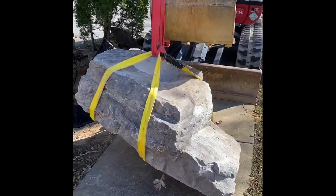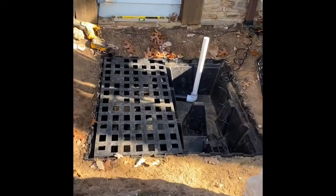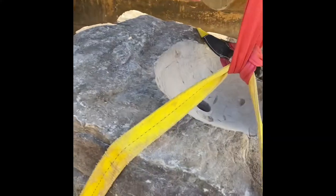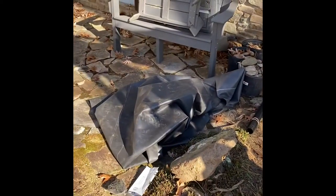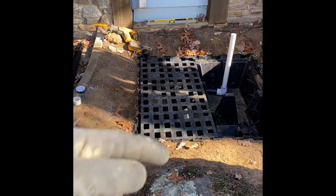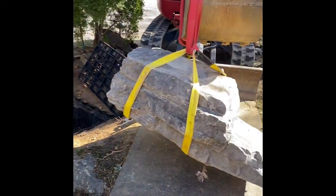We're back here. We got our boulder strapped and ready to go — it's all carved up, got the hole drilled in it, and we just got our plumbing set. Now we've got to set this boulder. The boulder's a lot bigger than the basin, so I'm going to have to put a skirt on it and basically wrap some liner around the edge so any water that spills out will still drop back into the basin so we're not losing any water. I think it's going to be pretty nice.